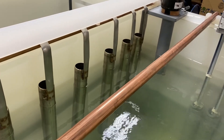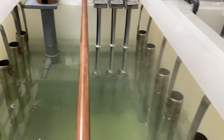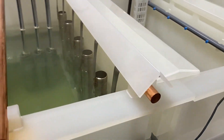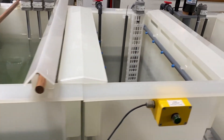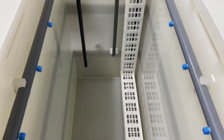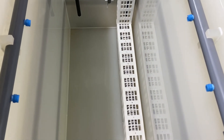The ventilated electropolishing tank features Teflon heaters, circulation, stainless steel cathodes, copper anode and cathode bars, and covers on the cathodes to ensure a direct short between anode and cathode is not possible.